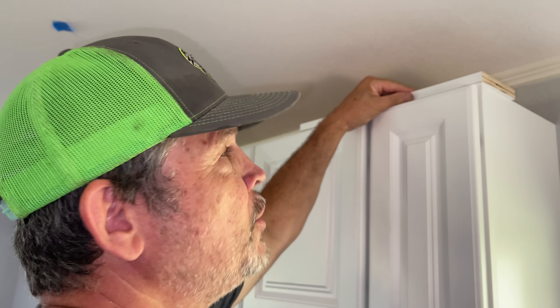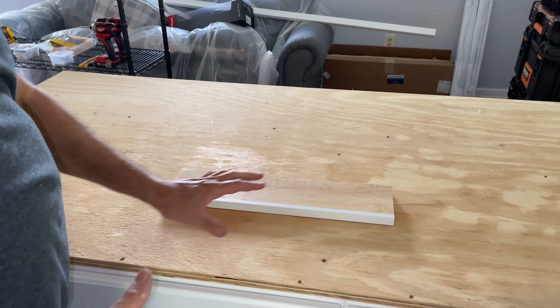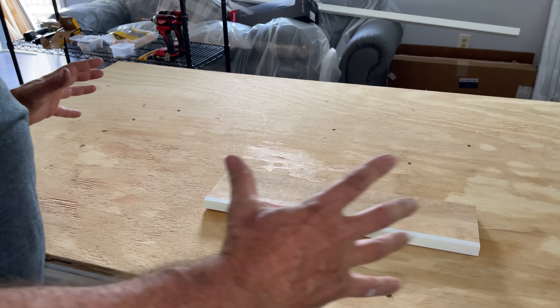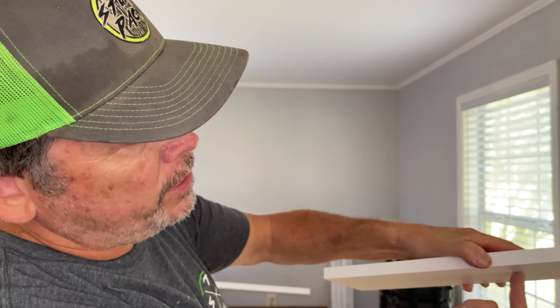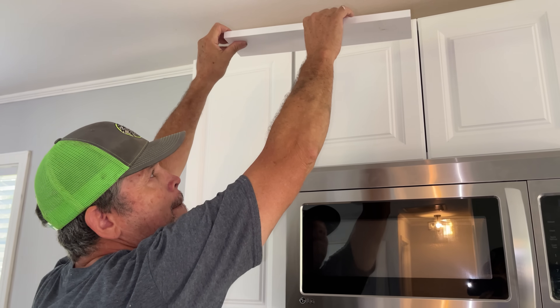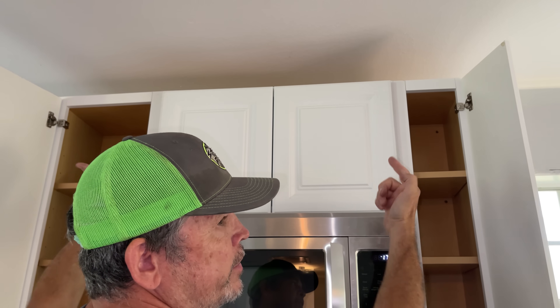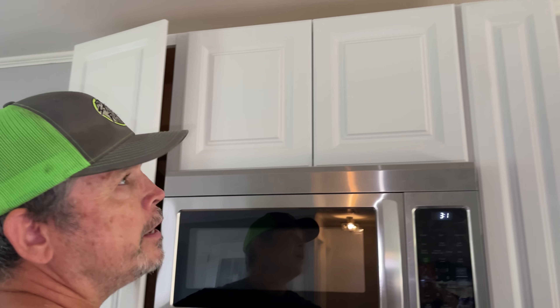So the way we're going to solve that issue is we're going to take the nailer down — we're still going to use it, it's a great idea. We're going to bring it down at a comfortable working height, put it on our work surface, attach the crown to it, build the whole assembly, and slide it up there as one unit with a few screws from inside the cabinet into the nailer. It's going to hold it there forever. Now that we have all of our crown attached to our nailers — the front and the side pieces as well — we can call that a modular system. We can take that whole assembly, put it on top, get our reveals perfect, open a couple of doors, run some screws into the nailers from inside the cabinets, and we are done.